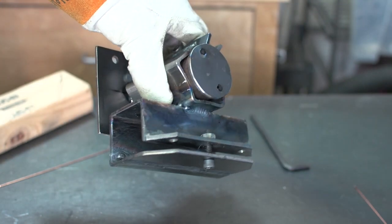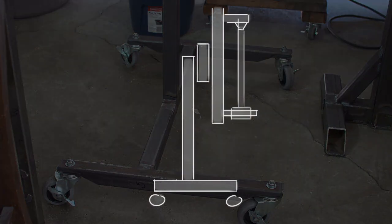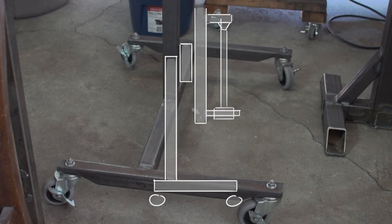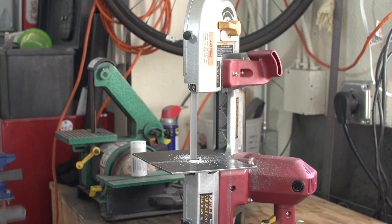Okay, so before I get this clamp on, I need to make an adjustment to the stand. The crossbeam is positioned at an offset from center, but I didn't offset it enough, and the jig is still front heavy. So I'll offset it even more because the new clamp positions the jig even further forward. To do that, this crossbeam will move back to here.